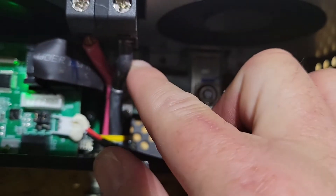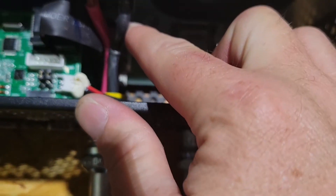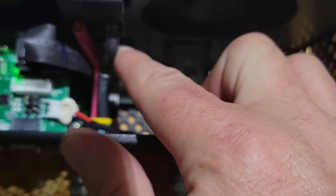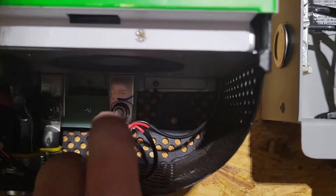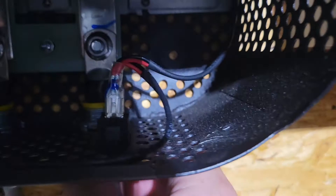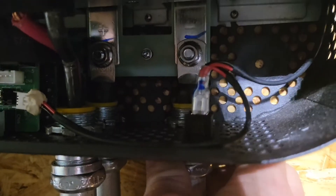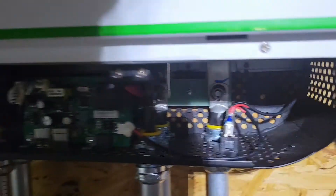On the DC input side for the photovoltaic, it's a number 6, but it is still tough to get those number 6's to fit where you want them. And then behind all of them, that's a half inch conduit back there. You'll see the half inch conduit right here — that is one DC conductor in a half inch conduit. So definitely tight, but it does the job. Gotta give it credit.